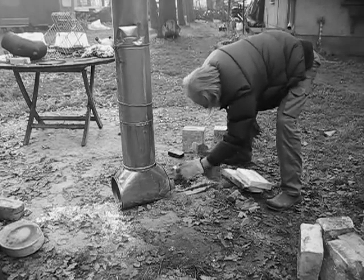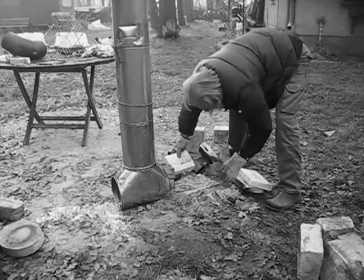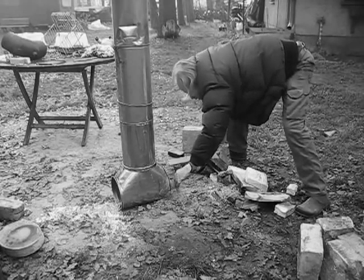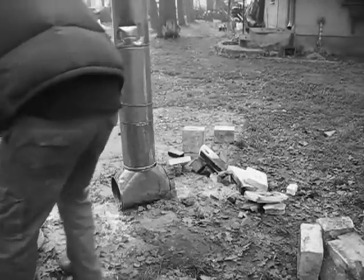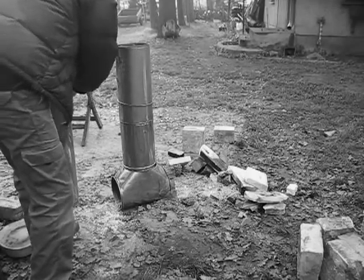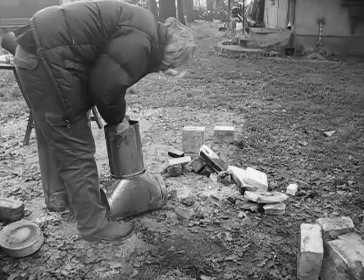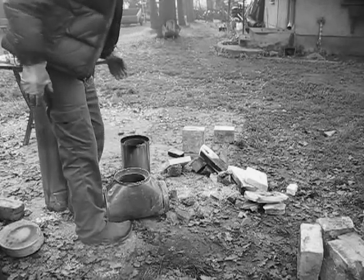You can see I've made an insulated place where the fire can burn from the bottom as well. I put these bricks here, and this is vermiculite here — it's broken down with the heat a bit. So here you had a nice hot fire going into this insulated pipe. It's quite easy to see now how simple it actually was. I built it as I was going along — these pipe sections here are a bit expensive, you're not likely to have these lying around. These parts are insulated. So it's dismantled now.